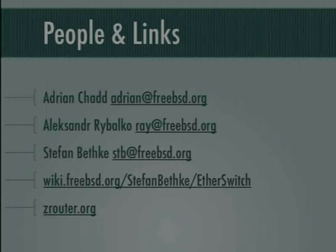Some of the vendor hardware will keep the serial port pads and the JTAG pads on the board. Most of them have it on there, especially if you're an Atheros reference designer, you don't want to change the JTAG pad. There are people in the open community who take, say, a D-Link off-the-shelf board, find the JTAG, and use an off-the-shelf JTAG device to speak to it. There are three or four people in the FreeBSD world using OpenOCD to do that. I haven't actually done it because I've been too lazy.